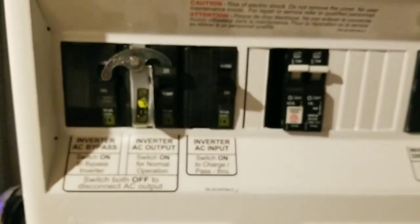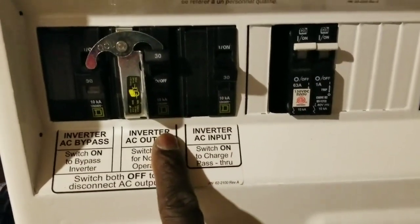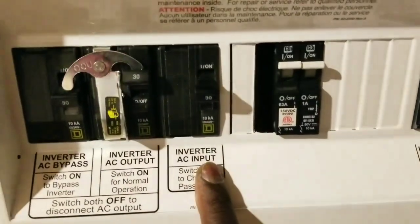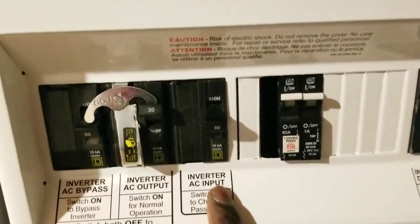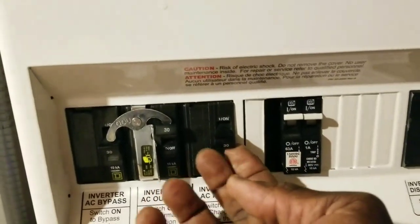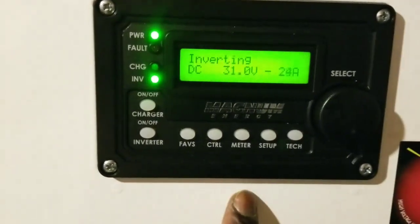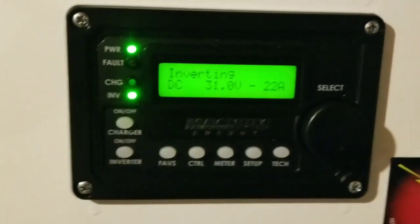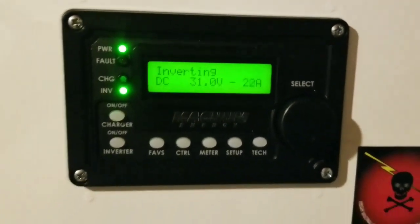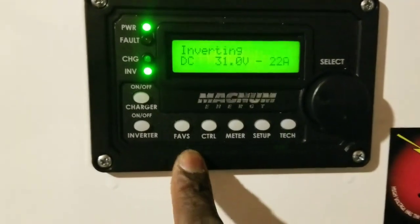Tomorrow he's going to exercise this thing. If you guys haven't seen the video before — we have a bypass here. This is the inverter on 30 amp; it's a 30 amp input AC. We already set it up so we can flip this one and stay on the grid as far as it goes to a state of charge of 80 percent, because of winter — that's why we decided to do this.